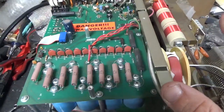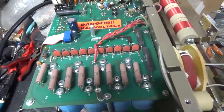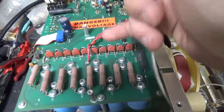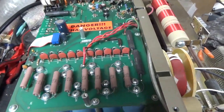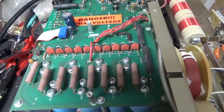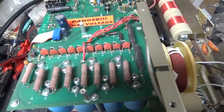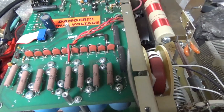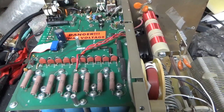I'll say it again: do not add more caps. What happens is if one of these opens, then you have an unequal amount of voltage across the capacitor it was in parallel with. If anything, with the larger Ameritron amps, just put caps in there rated for a little bit more voltage — go from 450 to 500 volt caps. You don't have to add a different board to add more caps.